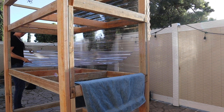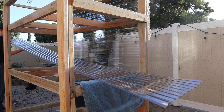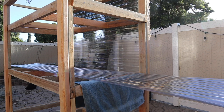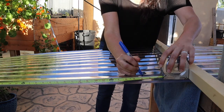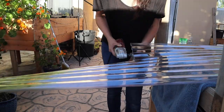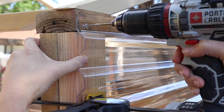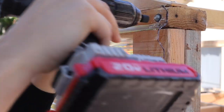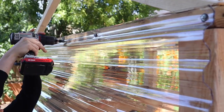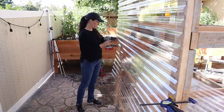My recommendation is to cut your plastic on something soft if you can. When you do use something other than scissors — scissors do not work well — my favorite tool for cutting plastic is actually hedge clippers. To cut in a straight line, I just dotted along the top of every hill and then followed that with my oscillating tool. To add the plastic I worked from top to bottom using clamps to hold it up, being careful not to drill the special screws too tight so as not to warp the plastic. I made sure to overlap — the top piece overlapping the bottom piece — to keep any water out.